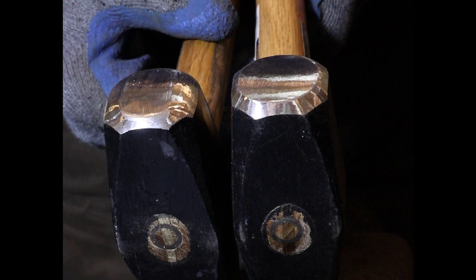The hammer on the left shows how you should be grinding the face of any cross peen or forging hammer. This view shows the main striking face, which is going to be used to do most of the forging at the anvil. This face is divided into two separate forging areas: the main striking surface, which is flat and directly in the center of the hammerhead, and two curved edges on either side of this flat section. The dimensions of these curved edges can vary and are really a matter of personal choice.